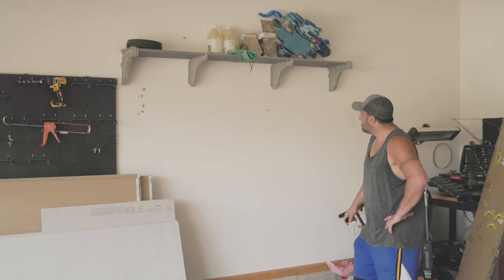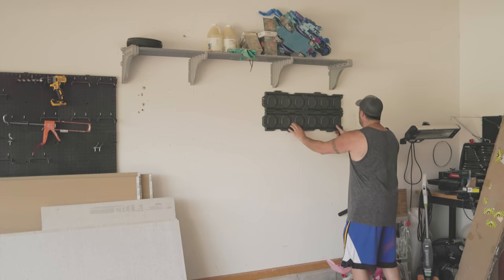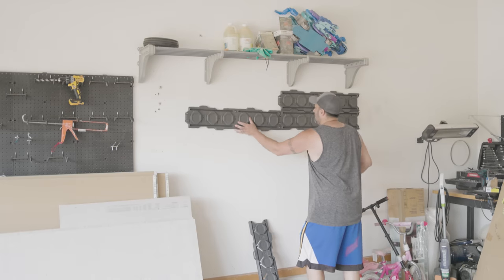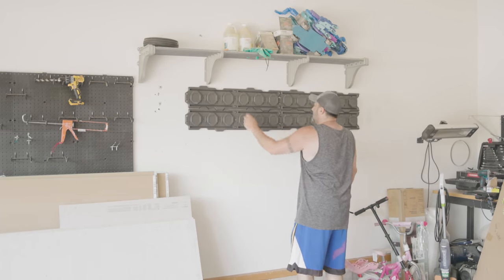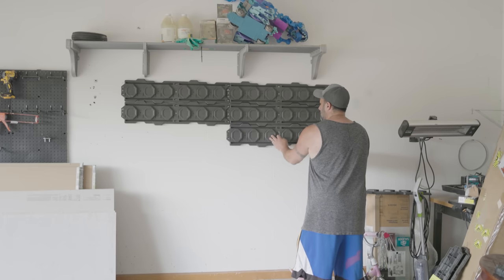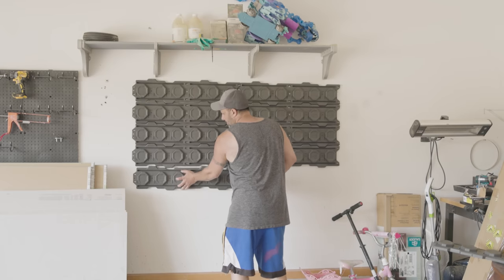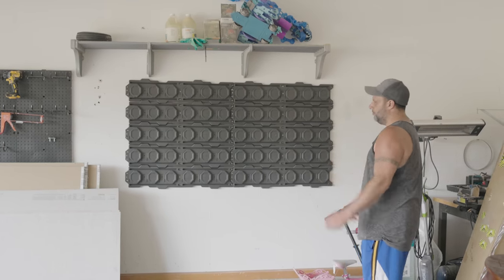Before I got started, I was like, oh, here we go — this thing's going to be a nightmare. I didn't really want to do it, but I leveled up my first piece and then it was so simple. Start taking these things out of the box. You can buy different kits, but these are the rails, the honeycomb, the system, the hanging brackets, and they just basically line up together once you get that first one level. It's super fast — you throw in a few screws, everything is super easy. If your studs are 16 on center, each one will line up. You do not need a stud finder other than for the first screw. It literally only took me maybe 15 minutes to hang that entire system.